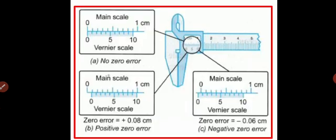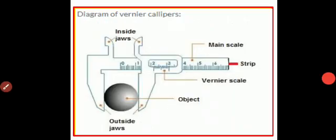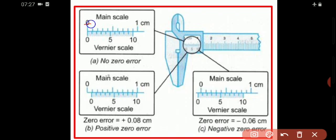If you see the diagram properly, look at the main scale division — that is from 0 to the first line. From 0 to the first blue line is a main scale division, abbreviated as MSD: M is main, S is scale, D is division. The value of one main scale division is equal to 1 mm.